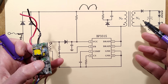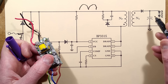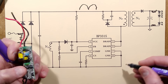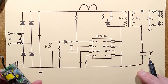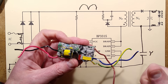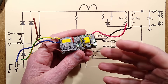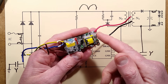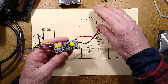This will all be déjà vu to people who watch this channel regularly, as I often feature this same type of circuitry. On the output we've got a high-speed diode — not a Schottky — the two smoothing capacitors in parallel, and a common-mode suppression choke on the DC output, plus a Class Y capacitor on the negative rail. It's more than textbook — they've really lavished the filtering on this. The big benefit is very little flicker, solid LED output, very good power factor, and not too much noise.